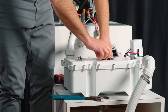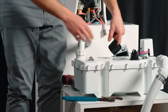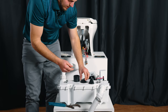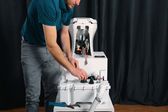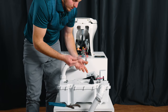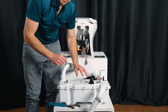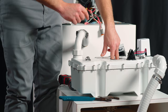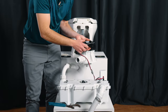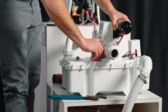Our other two duckbill valves — one right there, and the next one. Sometimes you'll have to grab that with the needle nose. Again, we don't care if they're east, west, north, or south. One duckbill valve going back in, then the duckbill valve collar. I usually inspect this pump-to-tank O-ring, grease it or change it. We heard it sucking air as soon as we picked it up, so it was holding vacuum — it's important to get a good seal here.